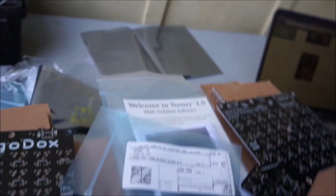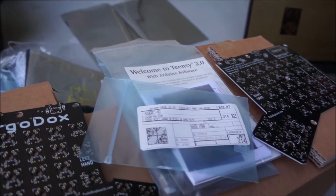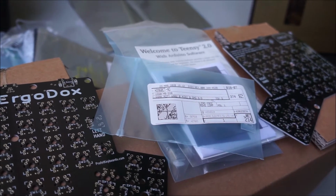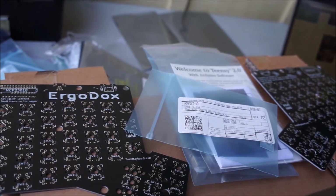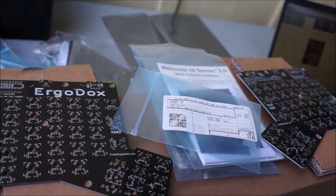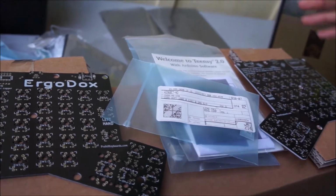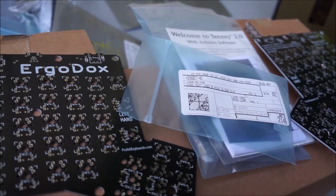And then after we install all of that, once the keycap switches arrive in the case, we can... So there's two types for keycap switches. Some mount to the PCB, some mount to a switch plate. I got the type with a switch plate, which comes with the case. So the case will arrive. We'll put the switch plate on, and then we'll put the switches over, and then you solder those, and then everything else from there is no more soldering. But fun. That'll be in a bit.